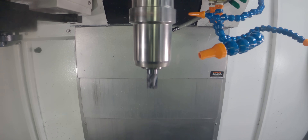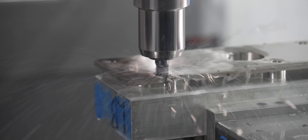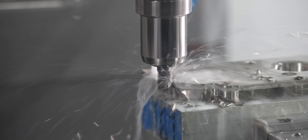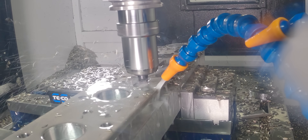This is one of the things we decided to get creative with. We're going to take a Harvey 1TE — you know we love it — and we're going to full slot around this part. Obviously we're going to stay off the finished surface a little bit, but we're going to full slot around it and get rid of that hat of material.